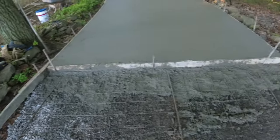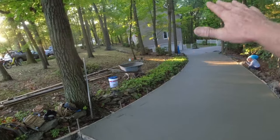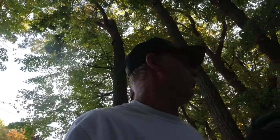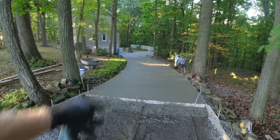So we bulkhead it off. Notice our wire and rebar run underneath on this hill. Down there on the flat where we get hydraulic pressure underneath, I don't like those tied together. We're all on very solid ground. If we tie the pads together and they can't heave if they need to ever so slightly, then of course it's going to crack. They never move very far.